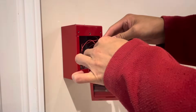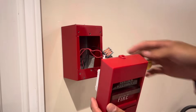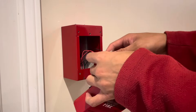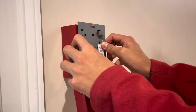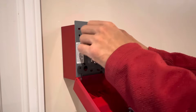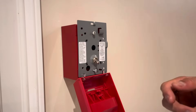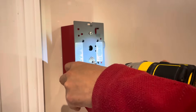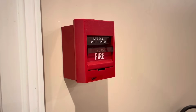Edwards, you don't even have to pay me to say good things about this product — but low-key, you guys should sponsor me anyway. Let's move on to the pull station. This is an Edwards SIGA-278 pull station. I've taken the wires out of the module because I'm running this on a conventional system. It's as simple as clicking these little WAGOs — though for most applications, this might not be acceptable. Especially for a conventional system like this, if the pull station were to come undone and a wire disconnected, the panel would not know that, because the zone would still be continuous. A lot of jurisdictions don't allow that because it's basically tee-tapping. Tee-tapping is when you have a continuous line of wire and tee off of it — that entire teed section will not be supervised. I'm not going to pretend I don't tee-tap a ton; there are several places on my system that are tee-tapped. But this is a demonstration system, so I really just care about functionality.